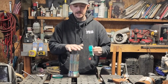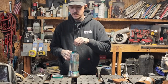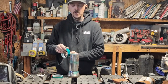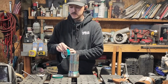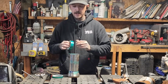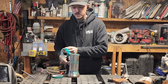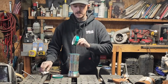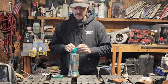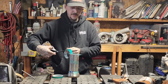And then the end of it, you can either, I've used balloons before. If you have a big enough piece where the heat's not going to be affected right here, you can actually blow up a water balloon, those little water balloons, blow that up with your air compressor inside of it, and that will block it off pretty well too. Foil works really well. You're probably still going to need to put some tape around the edges of the foil, but at least then it holds up to the heat and does the same principle.